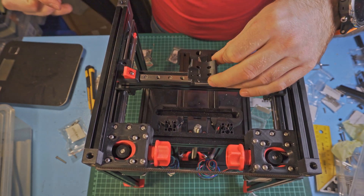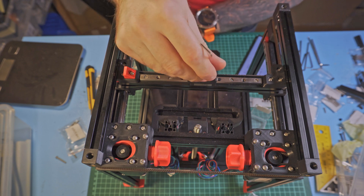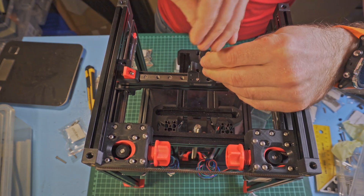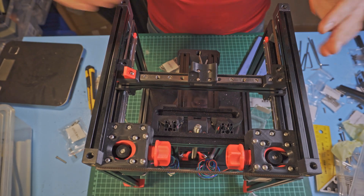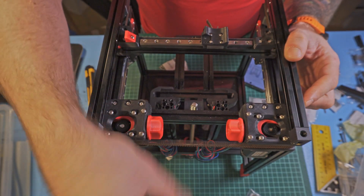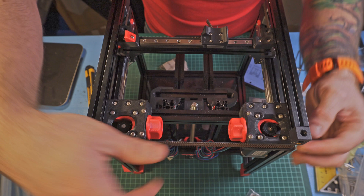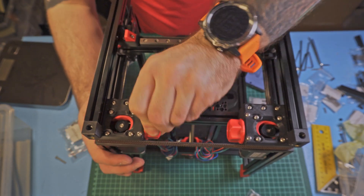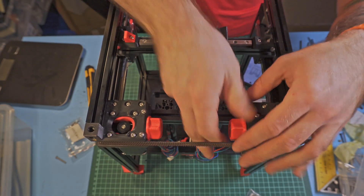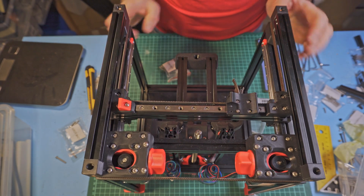Next I need to attach the centerpiece to the linear block. This is done by four M2 6mm screws. Let's see if it still moves — seems so. I'll tighten the belts a bit more; turning the screws is a bit awkward but it works. The belts are tight — I can even tighten them equally by sound alone. Thank you and see you in the next video, installing the bed.